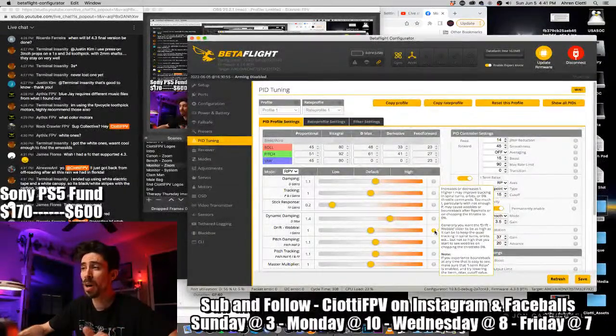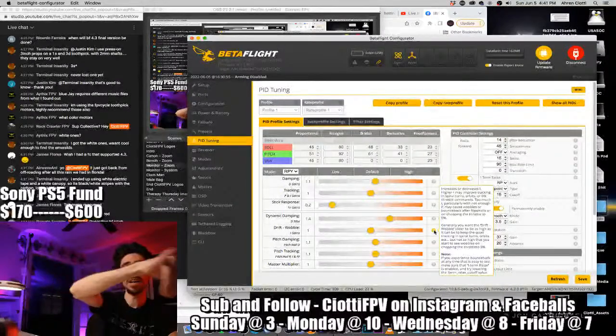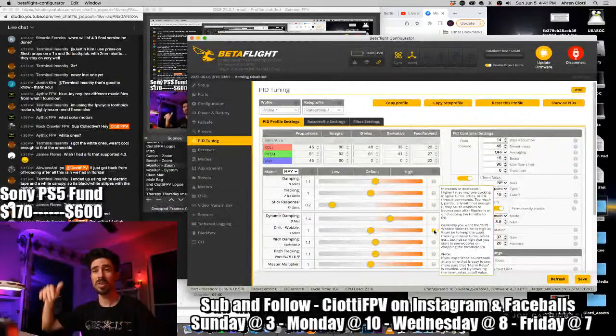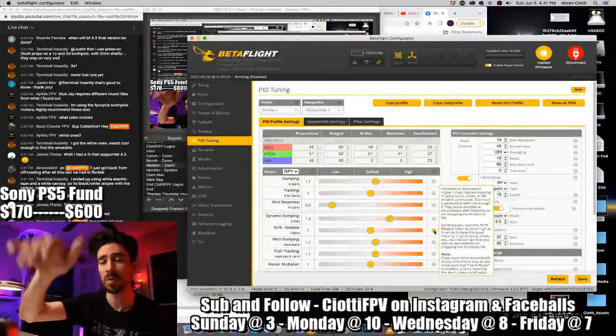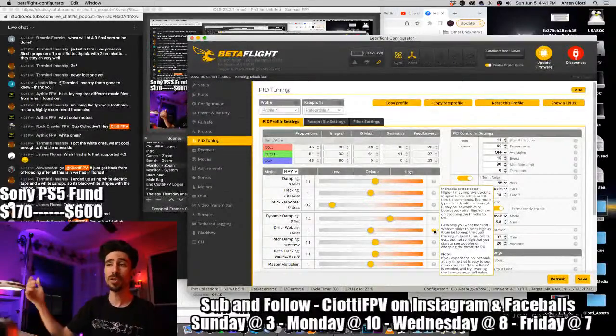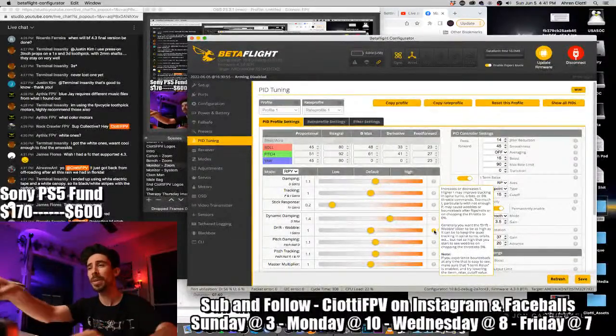Generally, you want the drift wobble slider to be as high as it can be to keep the quad tracking in spiral turns, but not so high that you start to see wobbles on chopping the throttle to 0%. The other thing that too much I gain can cause is a constant wobble. If you have a rig that's kind of shimmying around a little bit when you zero the sticks and try to fly perfectly smooth forward, try dropping your I gain down. Try dropping this slider down.